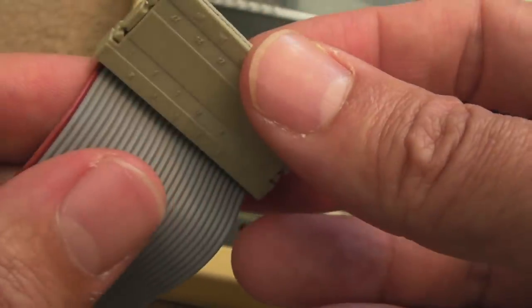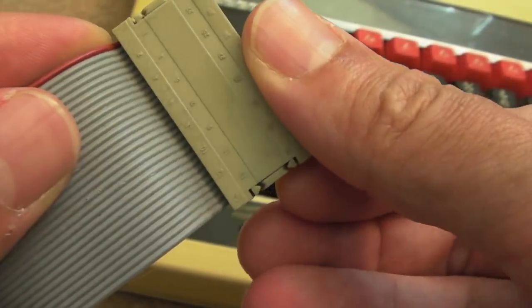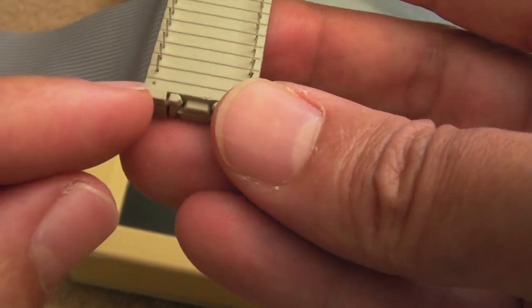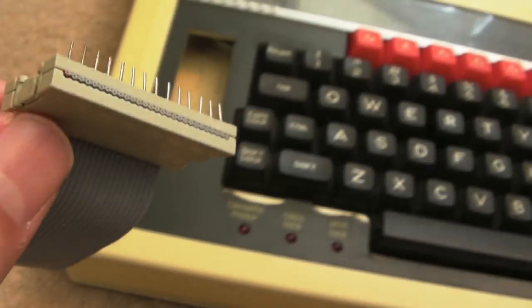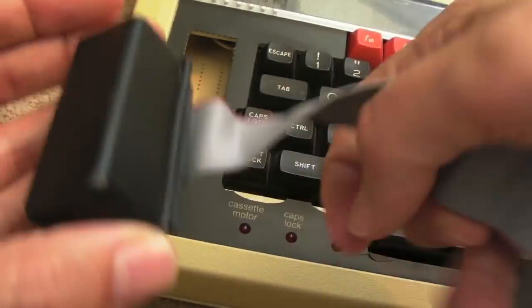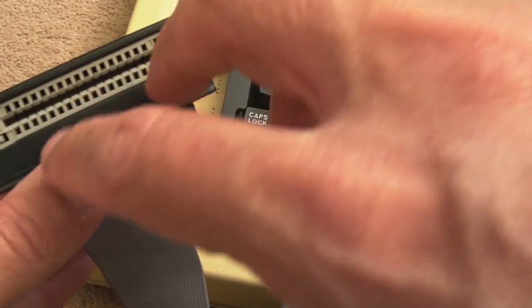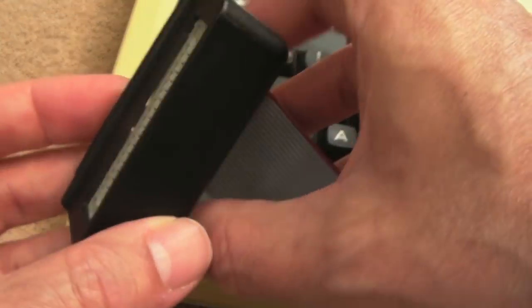I can see there's a pin missing. The easy solution would be to tack apart the thing and stick a pin in there, cut the plastic away to expose the metal, and solder a little pin on. I might do that. If it had a ROM chip socket on there that would be more useful — and I could always create a PCB with a ROM socket.